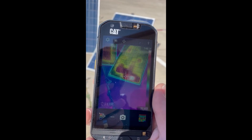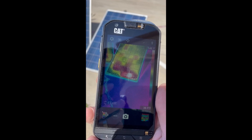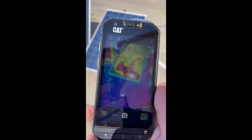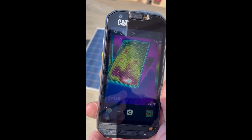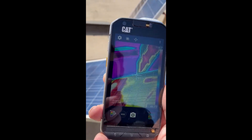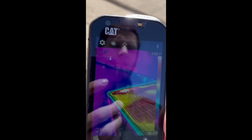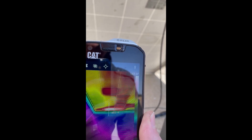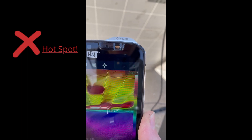The hot spot would indicate resistance. It appears to involve two different columns of cells. If this one were just getting hot because the adjacent one is hot, wouldn't the cell above it be getting hot as well? And it's still fairly cool. The glass throws the camera off a little bit, but viewing from a different angle it's definitely still hot back there. Checking the back side reads differently — and yeah, I think I found my problem.